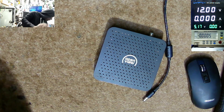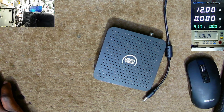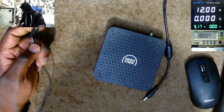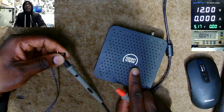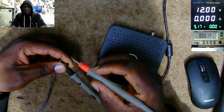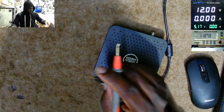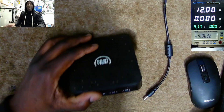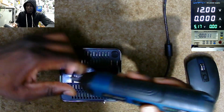So what you can check here is the customer's charger — check it to see if the charger is outputting 12 volts. Maybe the short circuit happened after this charger is gone. The charger is good, reading 11.9 volts. So here we have a short circuit confirmed.